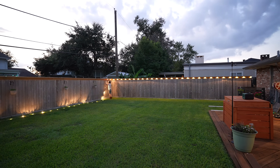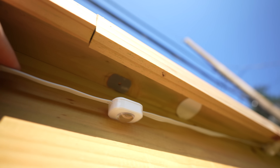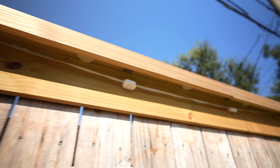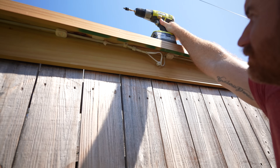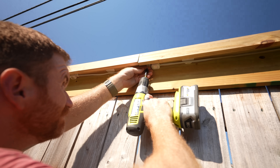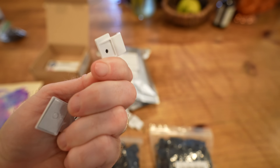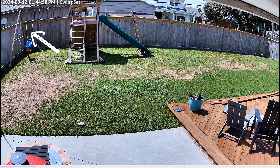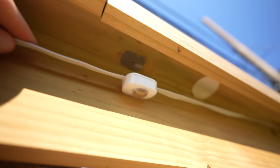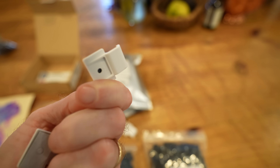One major side note: pretty much all the under-eave LED lights have a double-sided tape adhesive backing, and you should definitely use that to temporarily get them up, but you should come back and put brackets up. I tried a few different kinds — some even came with the Eufy, which were great, but they're not enough. I want a bracket on either side of each LED. Eufy comes with some in the kit, but I tried three different kinds off Amazon — I'll link everything in the description. After just a couple of weeks they all started to fall down, so I strongly suggest putting brackets on all of your lights. Your future self will definitely thank you.